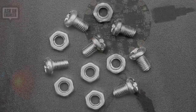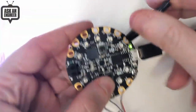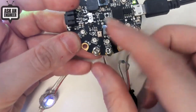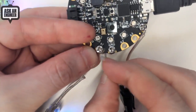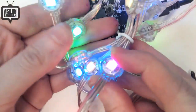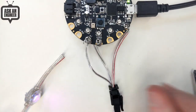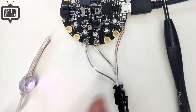Let's go to the overhead and I can show this off. Normally you can attach by soldering or clipping on, but that's really bulky. Say you have a bunch of NeoPixels or something with wires attached, and you want to connect it to your Circuit Playground — you just put the bolt through and screw it on. There's a little bit of space, you take the wire and hook it around, then take a Phillips head screwdriver and attach it. Now your NeoPixels are glowing and solidly connected without any soldering.